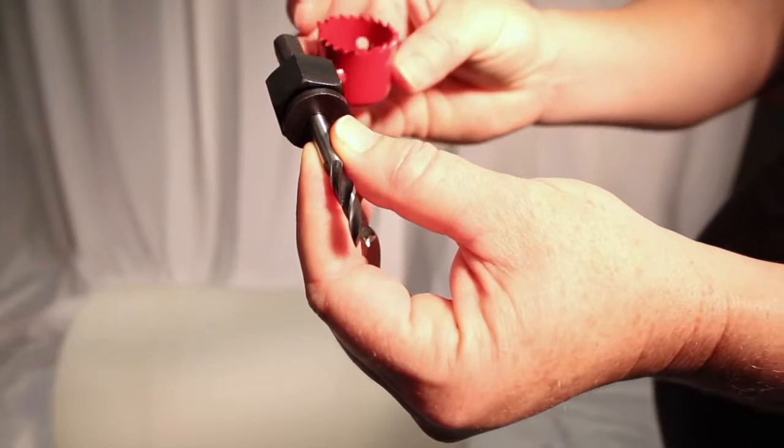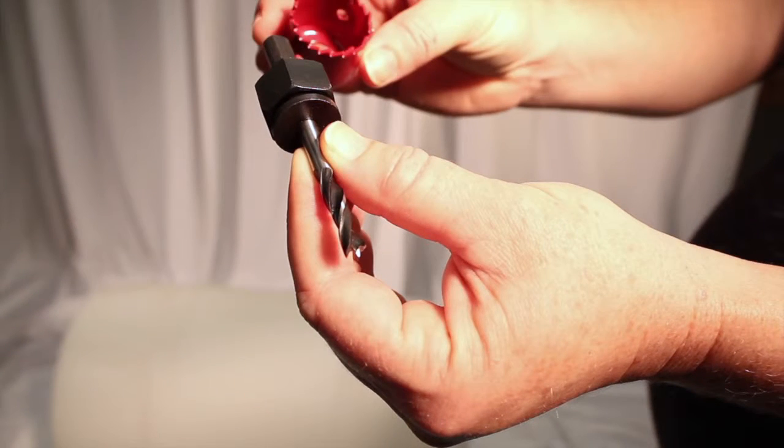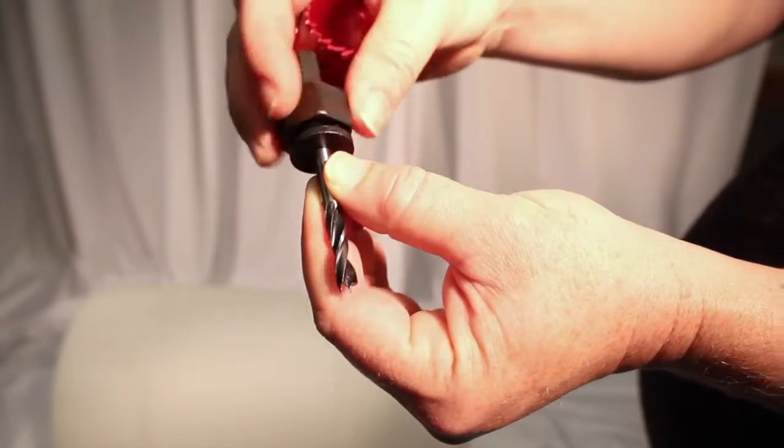Begin by laying the barrel on its side and have somebody hold the barrel while the holes are being drilled. The first hole saw you will use is the 1¼. It is the smallest one in the kit. It is important to use the smallest bit, otherwise your parts will not fit.